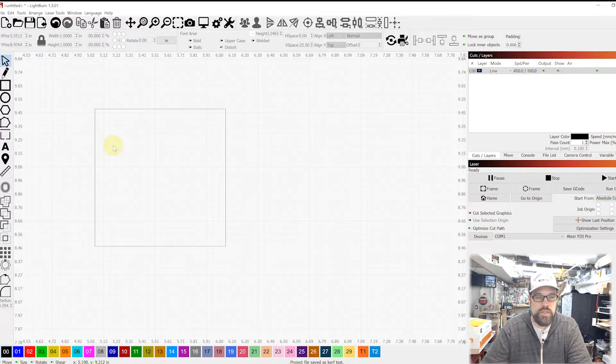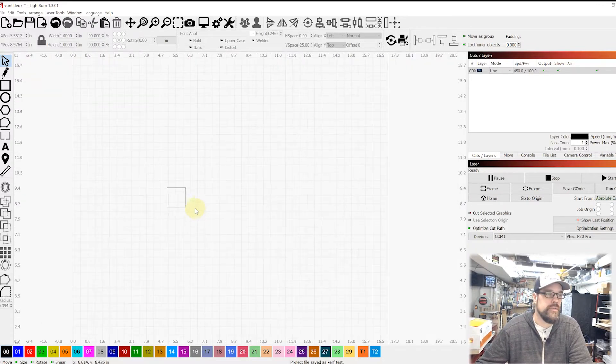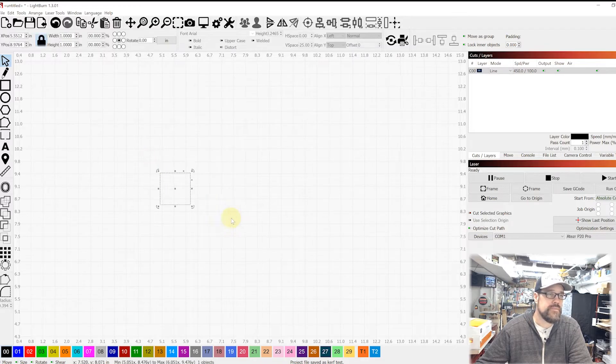It's good to do more cuts because the law of averages will come into effect. If you cut this once and it comes out as 1.98 inches, and you cut it again and it's 1.92 inches, there's variance. The more cuts we do, the more consistent the average for that material. There are variances in materials — soft spots, hard spots, air gaps, extra glue joints in plywood — so more cuts equals a better average.